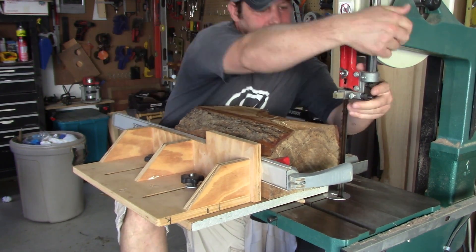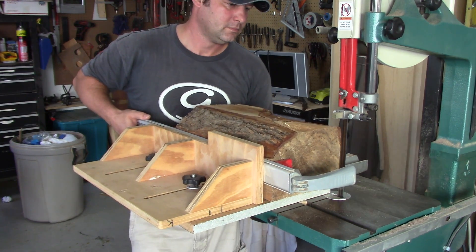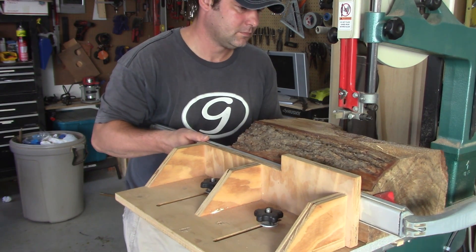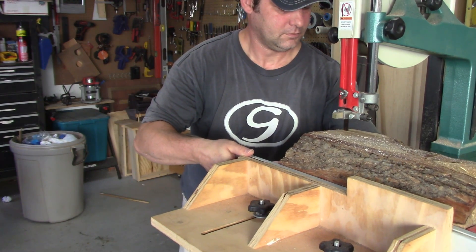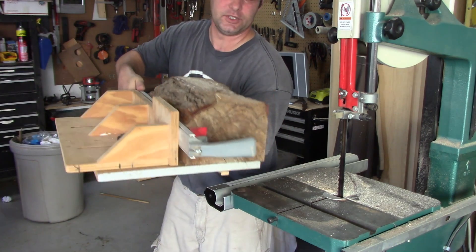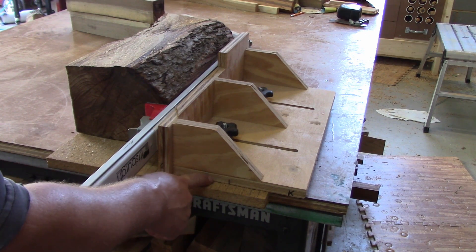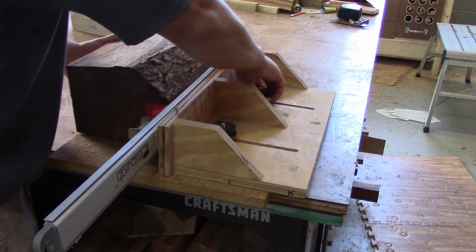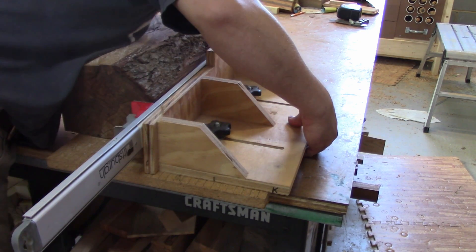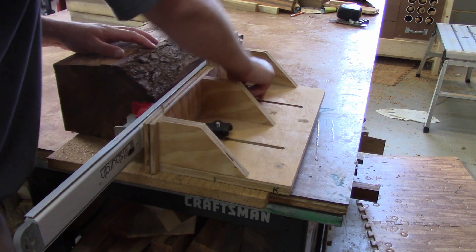There we go. I'm going to bring this down so it's just maybe a half inch above the lumber. Let's cut this through. So now what we're going to do is just slide this forward an inch. I have my reference line here, so I'm just going to slide it forward until it gets to there — and that'll be an inch of a cut. I check the reference line on the opposite side to make sure it's on the line as well.